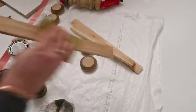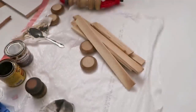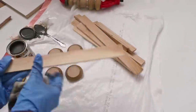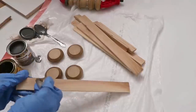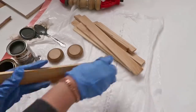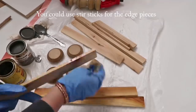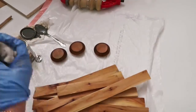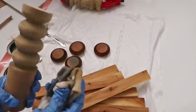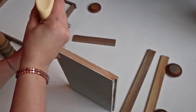I'm using two different stains because I wanted a coastal or driftwood color. I'm using Natural Stain by Minwax and Weathered Gray by Rust-Oleum. Make sure you use gloves or you will have stained fingers for days. I started by putting the Natural Stain down first. These wood pieces are ones my husband cut for the edges of the tray — I thought edges would look better. I did not wipe off the Natural Stain before I put down the Weathered Gray — I just layered it right over top while it was still wet and it seemed to work fine. I let those pieces dry overnight.